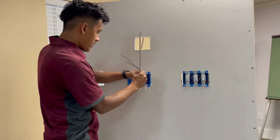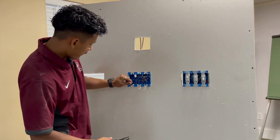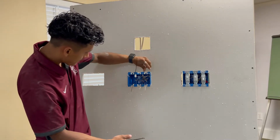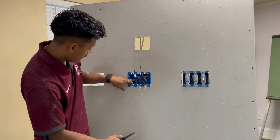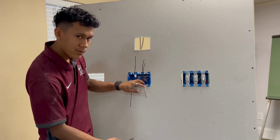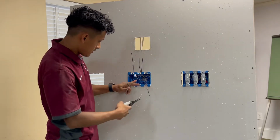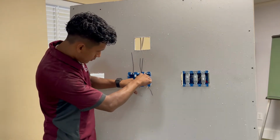And now going back to what I was saying at the beginning, the reason I put my 45s or my lights at the top is so that now I don't know which wire was cut at an angle, which one wasn't. But since I put all my lights at the top, I know which ones are going to be my lights, which ones are my hots, and which ones are my jumpers. So this wire, for example, is at the bottom, so I know this is either a hot or a jumper. This other wire right here is also at the bottom of the box, so it's a hot or a jumper, and that leaves my 3 lights at the top. And then just make sure you're pushing your ground all the way in as much as you can, out of the way. You have your neutrals in the back corner.